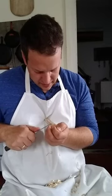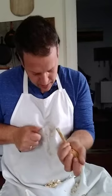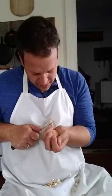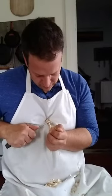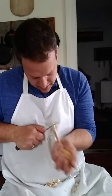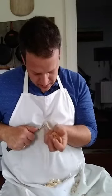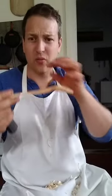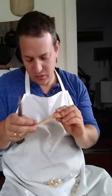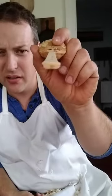Okay, it's a fairly delicate handle, so my facets are going to be on the small side. And basically, to get a rounded form, I do an initial facet, and then I kick a facet that knocks off the corner of either side of that facet. And in a very loose, organic way, I can get a nicely oval cross section. Now, obviously, I'm going to end up pushing this down a little more, but because everything is loose, it's just real easy to fit everything in. All right, so you can see now I have a fairly oval cross section there.